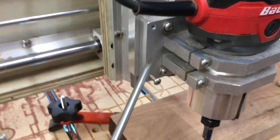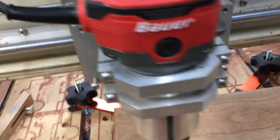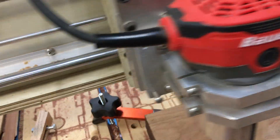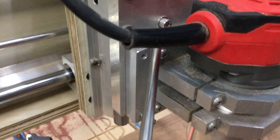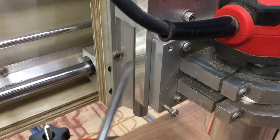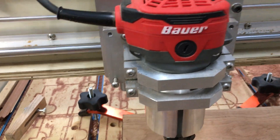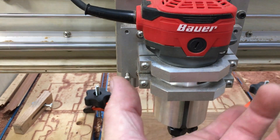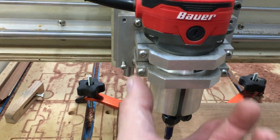What I've done is drilled four holes — two on each side — and those are clearance holes but they're oversized, and I've added a washer. They're really large holes, and I tapped four holes in this back piece. The idea is I can loosen those screws and tilt this back and forth in this direction as needed.